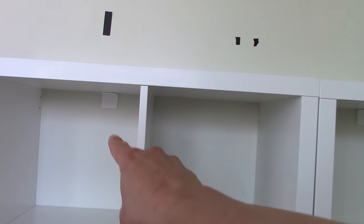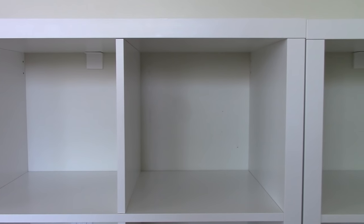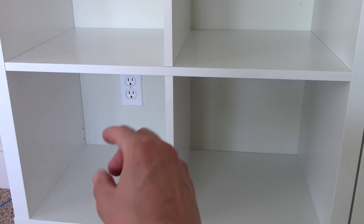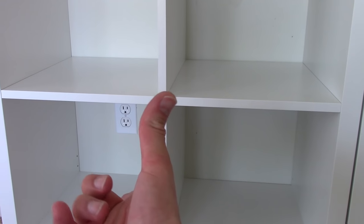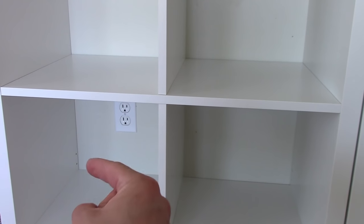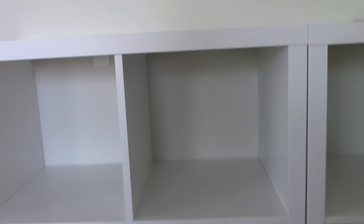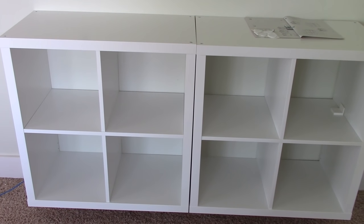This bracket is now installed into a stud. I just have to do the same thing on the other side with another stud and I'm done. IKEA will sell extra hardware in their returns department, so you can buy another bracket if you want. You can also get a drywall mount at Home Depot or Lowe's — not IKEA — that you insert and it flares out inside the drywall, so you could put more brackets on, although it doesn't hold as strong. You still always want to make sure you're attaching this into a stud. I hope that helped you — if so, please click like and subscribe. Have an awesome day!